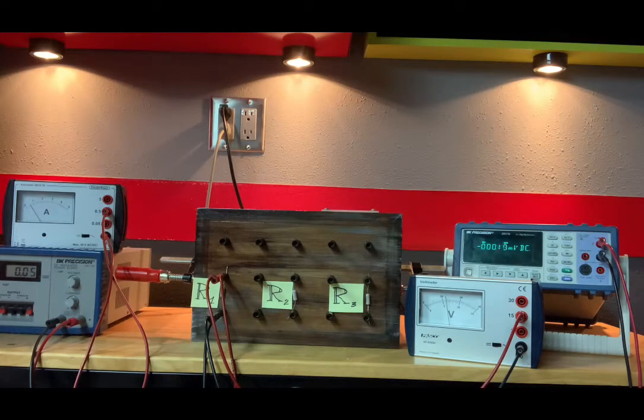So how do I get the overall error in my R? Well, I just calculated the fractional error, which is 0.13. So I'm going to multiply that by the value I calculated for R, which is 110. So 110 times 0.13, again to two significant figures, is 14. So my error for my R1 is plus or minus 14 ohms.